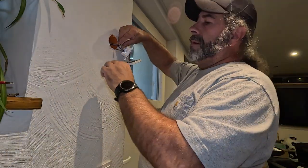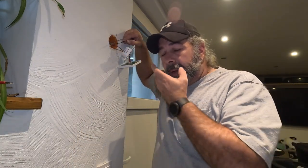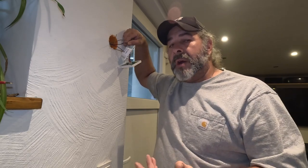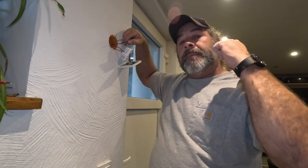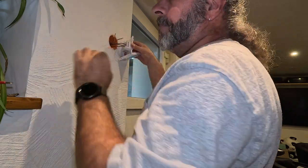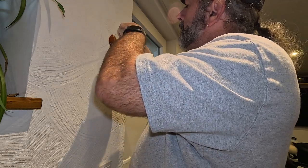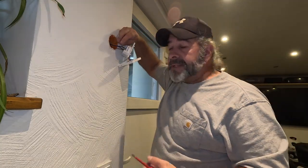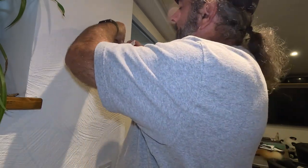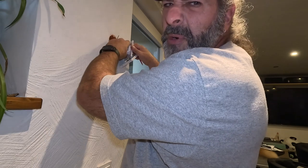Then, like I was saying earlier, I'm going to use the black. Because I'm used to DC, the black is the negative — negative, neutral — so I'm going to use the black out of this five-wire bundle to feed the neutral out to the valve. And then last but not least, the gray wire. Remember, because my valve is a normally closed valve, I'm going to put my gray wire in the open terminal. I'm repeating myself to make sure I'm putting it all together right.